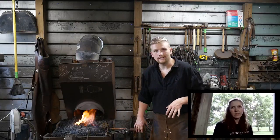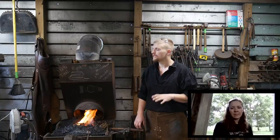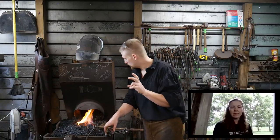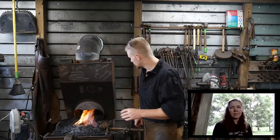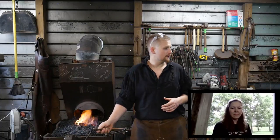I've got a piece of 1 inch, or 25 mil roughly thereabouts, wrought iron round in dimension and cross-section. I've got it on a fairly long bar here and I'm going to forge out what I need, make sure it's getting to the right shape for my two cheek pieces, and then it'll get parted off from the bar. So we're going to try to get these prepped tonight.